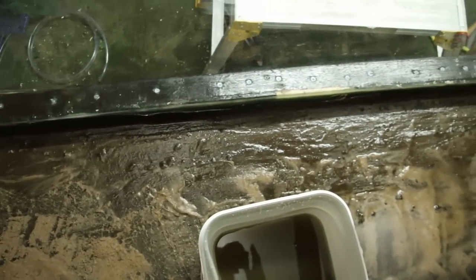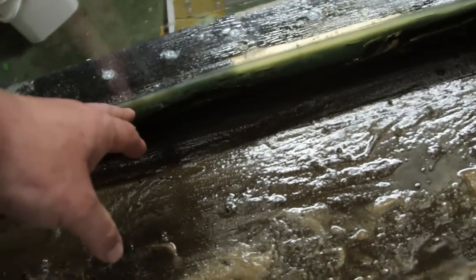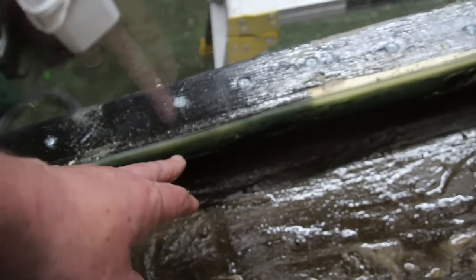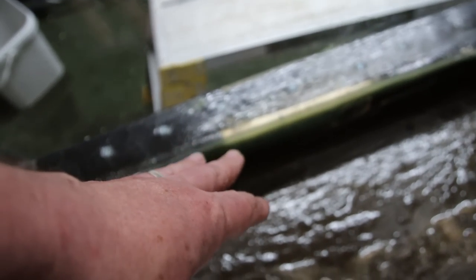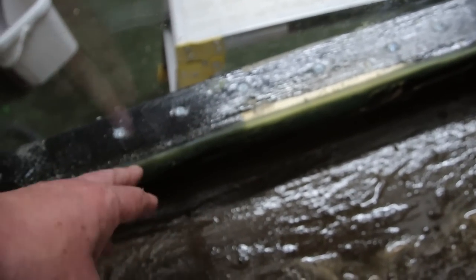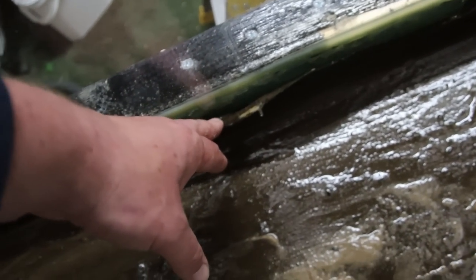Right, okay, now we're inside Megatank. I've cleaned it up a bit and I can see what's going on and what the problem is. Looking down here, where I was having all the problems before — we fibreglassed the glass in and siliconed it. Basically what's happened is the pressure has built up over time, pushed that wood out, and as the wood has moved it's delaminated. So all this middle section is basically coming away.